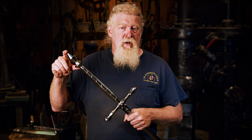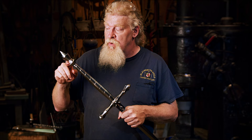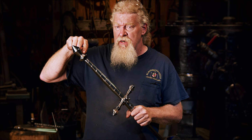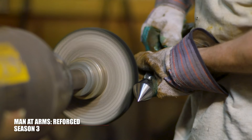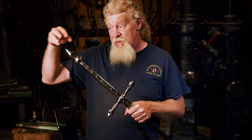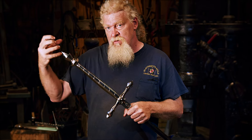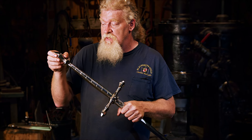This pommel shape I could have turned in one piece, but we made it in two pieces. The real reason is that Matt goes in and cuts these scoops on the inside, and we didn't want that to show. So we made sure it was a separate piece. Both pieces are threaded — this one goes down and acts as a lock nut, with a pretty big thread to give it a lot of integrity. We had to do it in two pieces to get the inside and outside facets.